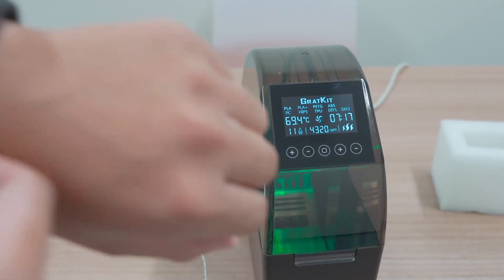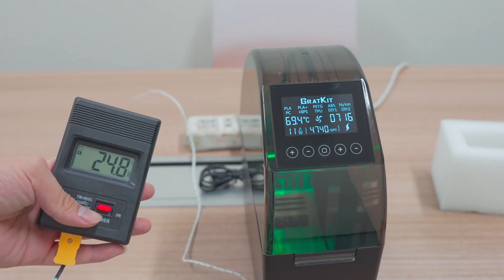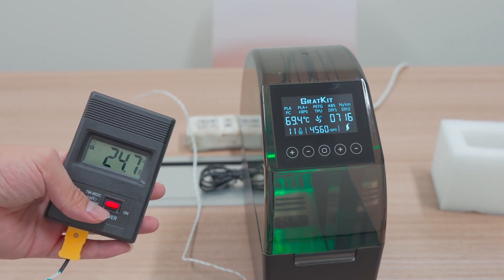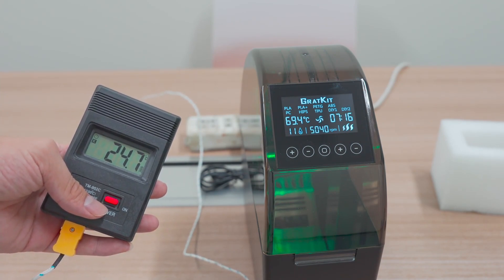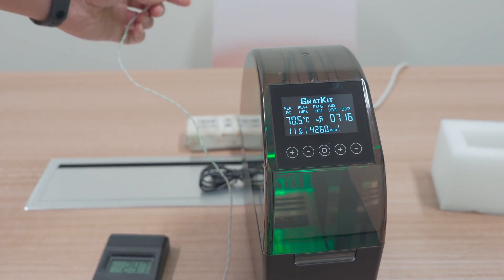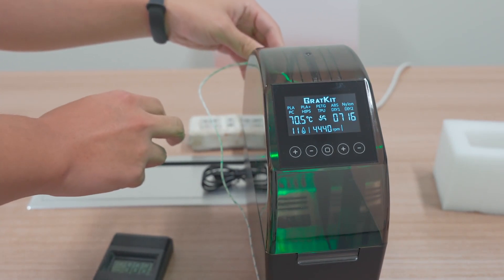After the adjustment, we can see it can reach 70 degrees Celsius. The time elapsed is about 45 minutes. When you have finished this fix, it can reach 70 degrees within one hour. The room temperature is about 25 degrees. Now we test the actual temperature — we put the sensor to the center of the drying box.